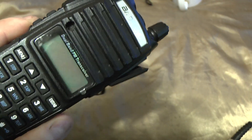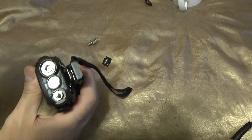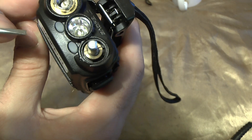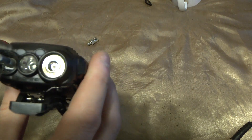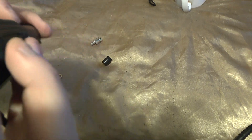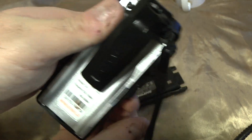Hello folks, this is a UV-82 teardown so that you can make a bigger hole for your microphone to get more sound in, as the little hole was restricting. What you do is you take off — just yank off the volume control, get yourself a screwdriver to de-spin the thing, and take off that little bit off the volume control. You can use small pliers or de-spin it another way. Spin off this thing here, and de-spin the antenna bit off there.